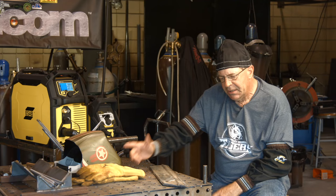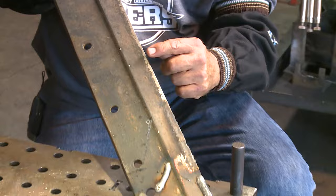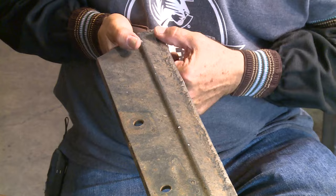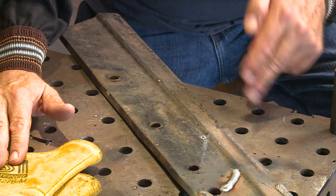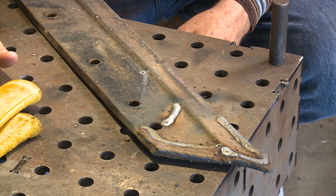I shouldered up against the other welds to get some buildup. This thing was cracked across here, showing some real fine transverse cracks across whatever was on here before. This section is worn, as you can see, and then it goes into the regular material. So there's an overlay on here, and apparently whatever it is, it cracked across it in a transverse fashion — it must be super hard and didn't like what it was on. I welded over the top of that as an experiment to see what was going to happen. This stuff did not crack; it sealed everything back up.